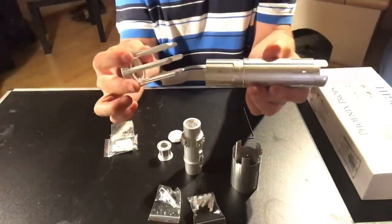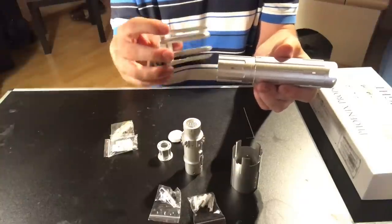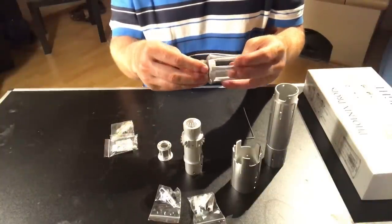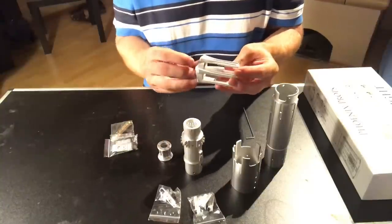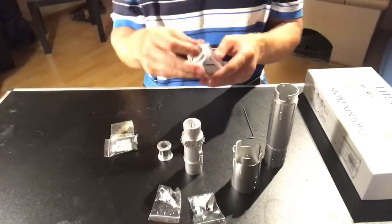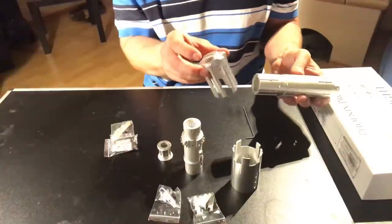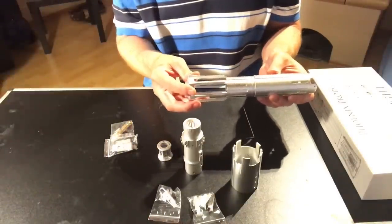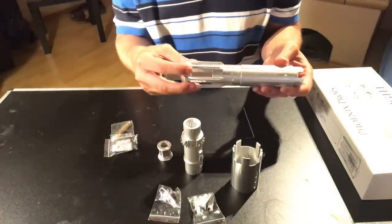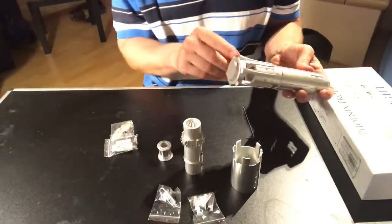These fins will separate as you like. Pay very special attention because if you turn this, your end cap is going to end up at a different position. So whenever you put everything back together, first thread on your end cap. The end cap has a U shape and goes on in a very specific way, so you're going to want to make sure it's properly aligned, and then put it together so you end up with a proper alignment. If you spin it, your end cap will be off center.